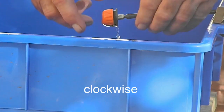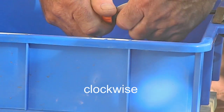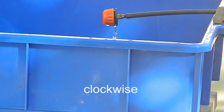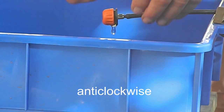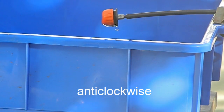I will now show you how to adjust the water usage. If you decide that your plants are not getting enough water, then turn the control dripper clockwise to increase the water usage. On the other hand, if you decide that your plants are getting too much water, turn the control dripper anti-clockwise to decrease the water usage.